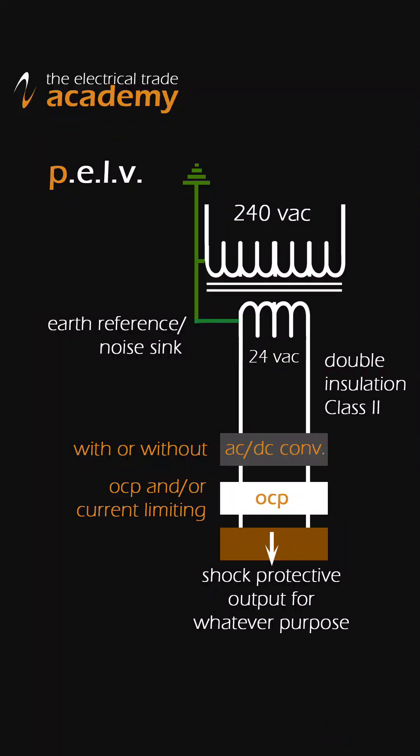Sometimes that total isolation isn't practical, especially in control systems that need a stable zero reference point or to reduce electrical noise. That's where PELV — Protected Extra Low Voltage — comes in, and that's achieved by one side of the transformer secondary winding being earthed or grounded. You'll find these in, for example, the control circuits of HVAC — heating, ventilation, air conditioning — systems, where the earth reference keeps control signals steady and drains away electrical noise from motors and long cable runs. Compared to SELV, with PELV you do trade a little of the inherent shock immunity for stability and noise control, but application and environment become key in the safety design process.